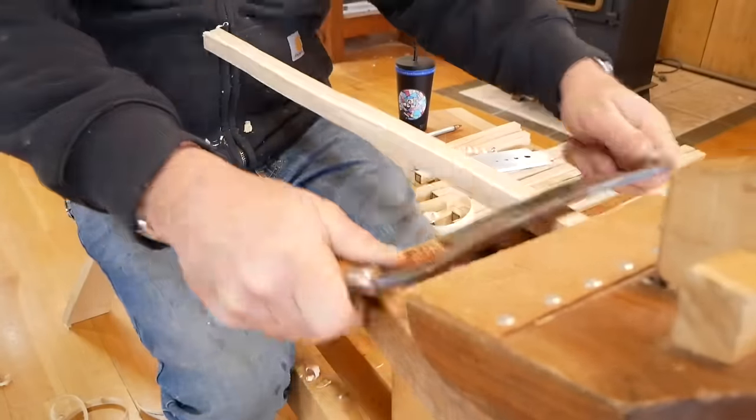And now this is the gutter — this is a little quarter-inch-wide carved line. We never exceed that line, we never go past that line. And now this is the fun spot. We drilled two holes to give us a depth — you can see them underneath my scoop there. This is called the potato, which is just another scooping scraper carver. Lots of different scoopy scraper carvers, some handmade by some of Greg's friends in the chair-making game — some really beautiful old traditional tools. The whole time you go down the grain; you've got to go down the grain. I always say, go down the steps.